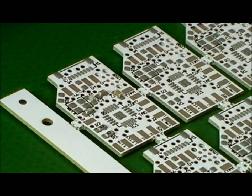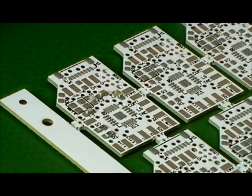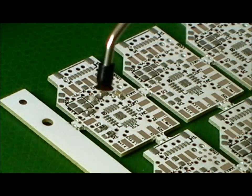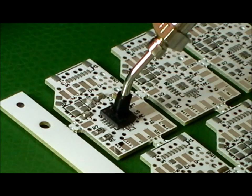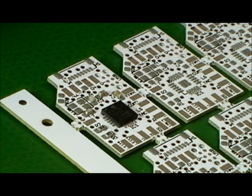I'm just doing one PC board this time, all the components, but after this I'm going to show you the process I really use to do a whole panel. It's much easier to place one component at a time on all of the panels. This is a vacuum suction tool. It's a hand tool. It costs about $80. I use this for placing microchips. Got one more piece here.